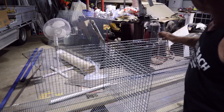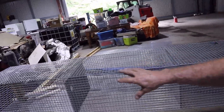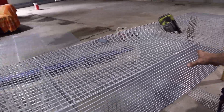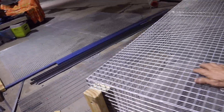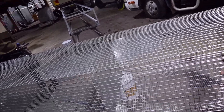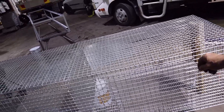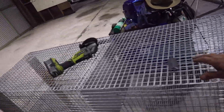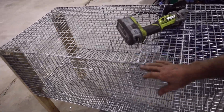What I'm going to do now is put the dividers in all the way along here. I boxed it up because I didn't want all the joins in one place. I put this one in the middle — the side panel — and added two pieces at one end each. And on the other side, I ran a full sheet and stopped just shy of one of the holes on the other side. What that did is it staggered the joins. And on the top, I ran it three meters and then joined it there, as you can see. So it's all been matched up.